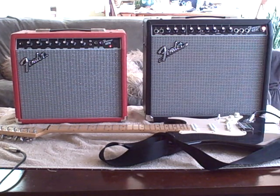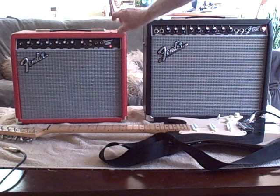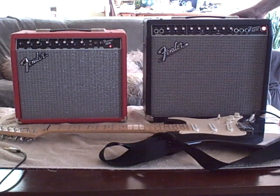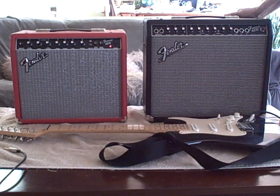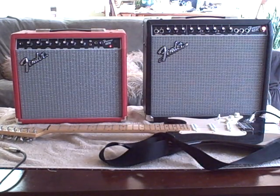And second of all, you're also going to hear that when you first turn this amplifier on, you're going to have about a 2 second hum, and then that's going to go away. And that's definitely true. Let me turn this off. By the way, the power switch on the 25R is in front here, whereas the power switch on the 65 is in back. They're both open back amplifiers. Both use IEC power cords, a standard old cord that everything uses. Let me turn this off. Give it a second to decharge there. Turn it back on. I don't know if you'll be able to hear this or not. Okay, it stopped. So for about 2 seconds, there's a light sort of humming, and there are kits on the market where you can get that fixed and so forth.